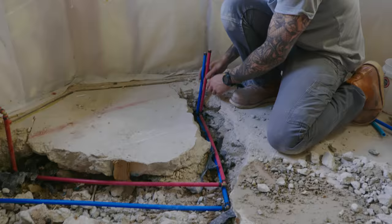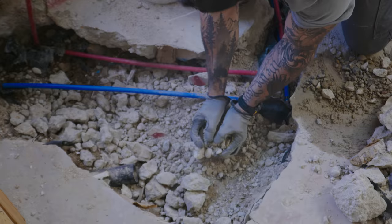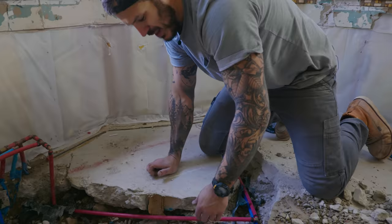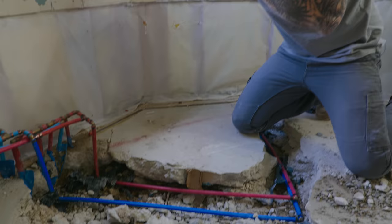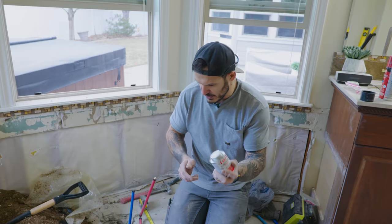Water lines are cleaned up — piggyback coming down here, going across, and I'm going to have them in a small circle right here. What we're going to do next is start excavating all this out, connect my extension drain, and make sure all the plumbing sits completely underneath the concrete. If it gets caught in the strengthening process it'll crack, so we want to avoid that.